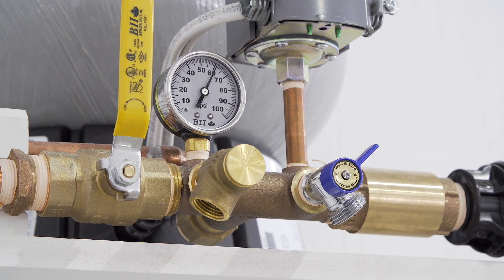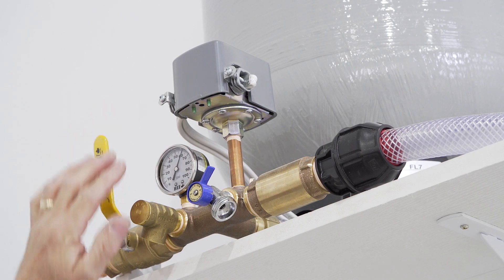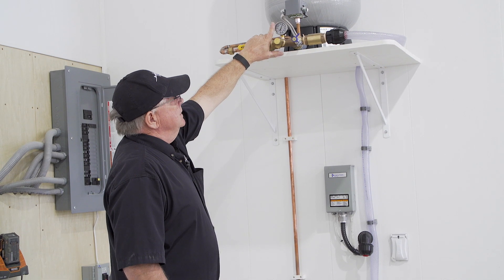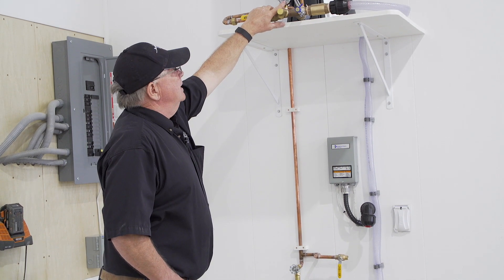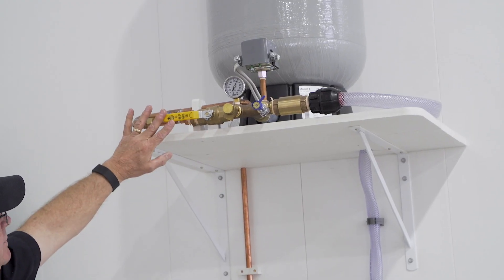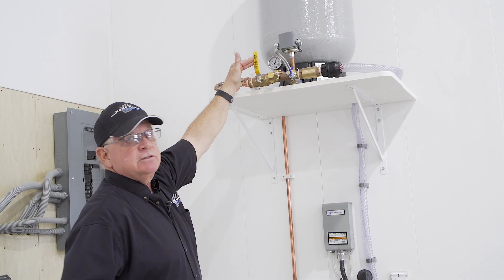This is a fairly standard manifold, but it's done with ultra high quality componentry. Everything is brass, and the pressure switch is a Square D pressure switch. We also put in a liquid-filled pressure gauge. The liquid-filled gauge is really nice because the indicator doesn't bounce around — it stays steady and consistent, making it easy to read and very accurate, and it makes for a much nicer install. We have bibs here to clean out sediment, a high pressure relief valve, and a valve that turns the pressurized system to the building on and off. When it's in the direction of flow it's on; when it's 90 degrees to flow it's off.